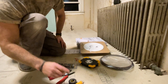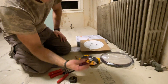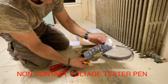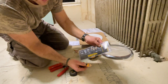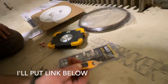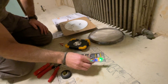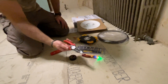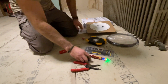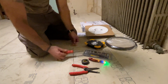If you are not sure — as in this house, all the wires are black — you get a little tester. This is by Klein Tools, it's about 20 bucks at Home Depot. This is dual, meaning you can also detect 12 volt, but there's one that's only for AC power which is a little cheaper. You turn it on, put it to a wire, and it lights up red to tell you if it's live or not. You'll also need a wire stripper, some electrical tape, the wire connectors that come with the light kit, and a screwdriver or wrench to remove your old lamp.